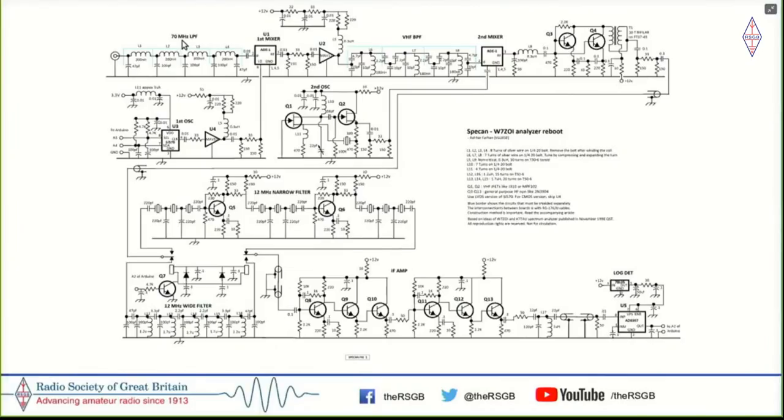And then I started thinking about why can't we apply the same principles to a regular radio, let's say 0 to 30 megahertz. Now, instead of the complications of a dual conversion radio, I thought it might be easier if we just use a high IF like 20 megahertz. So what would happen is, imagine that you are at 80 meters or 3.5 megahertz, and you had to upconvert this to 20 megahertz. So you would use a VFO at 23.5 megahertz, right? And the image would be at 20 plus 23.5 megahertz, which is 43 megahertz, which you can easily filter off with a 30 megahertz filter.